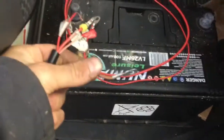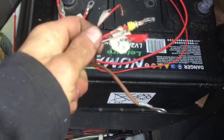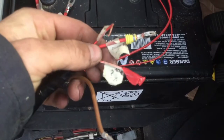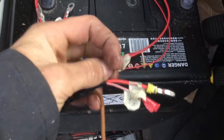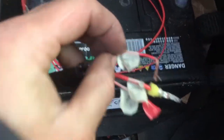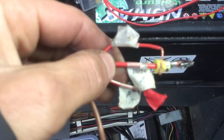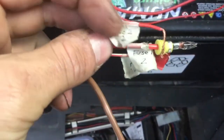Onto the other side of that fuse box goes the cable from the wiring loom. As you can see here, we've got the brown cable which is for the negative feed, and then we have fuse 1 and fuse 2. I've got these marked up — it is as simple as a thicker wire goes to the thicker wire in the fuse box. You can kind of just do it off the gauge of the wire, but I did label everything up. The other wire is for the ADR unit, which we're not going to look at in the fitting of this van.